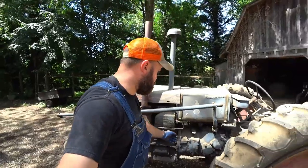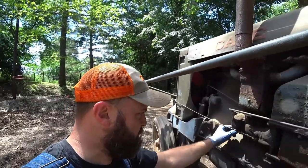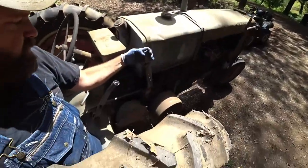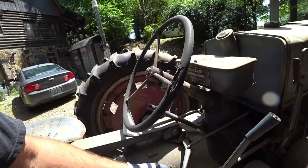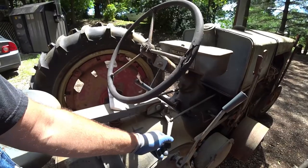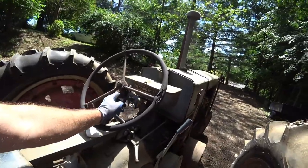All right, we're gonna try this, guys. We'll turn front fuel petcock on. Make sure that we are still getting fuel. But we're gonna set the brake. Make sure the clutch is disengaged. So we're in neutral right now. Throttle is somewhere around half set. Magneto, so somewhere in the middle. I'm not sure on our switch.